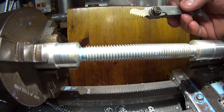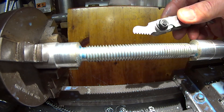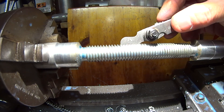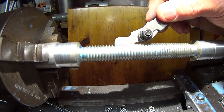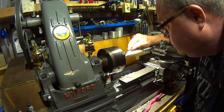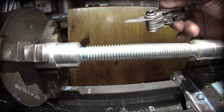I'll now turn it off. Get your Whitworth thread gauge and — I don't know whether you can see that on the camera — it should now be a pretty good fit. As long as the teeth reach the bottom and it's not bottoming out, that should be a pretty good thread. Yeah, that looks pretty good. I think that'll be satisfactory. So all I've got to do now is try and get a nut on this thing.